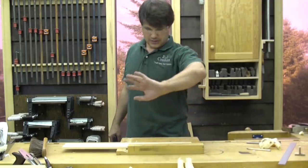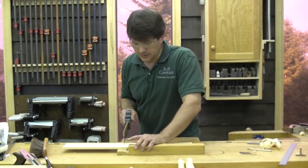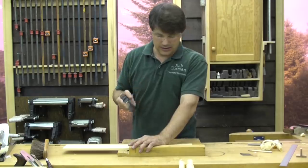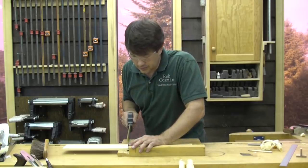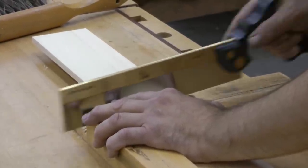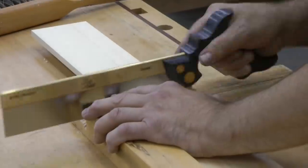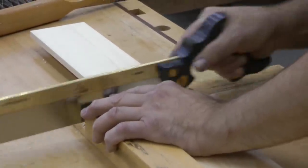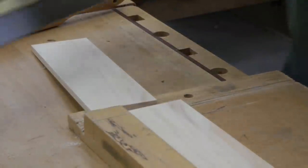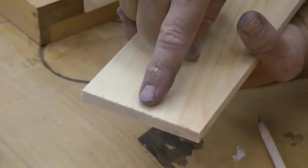Squeeze the two pieces together — I'm keeping it tight to the fence. Use my finger as a guide to get that cut started. Depending on how good you are with the saw and how good your saw cuts determines how close to that line you can trust yourself to get. The saw that I've got has a real narrow set, so minimal tear out. I can't say too much about it because I make them — that would sound a little bit self-serving — but it does cut beautifully.